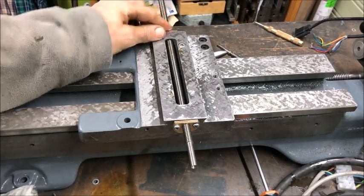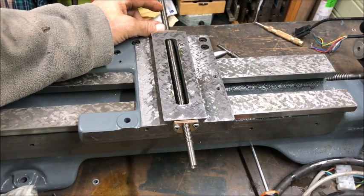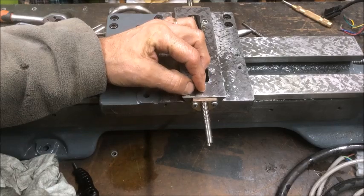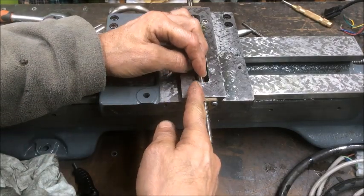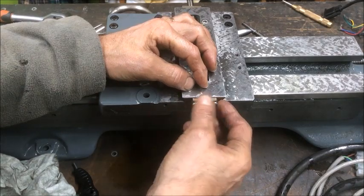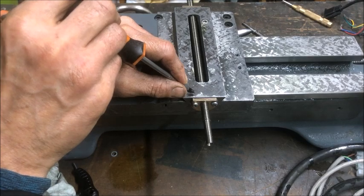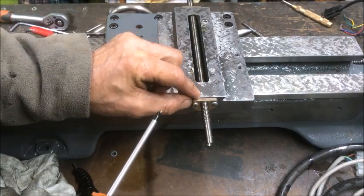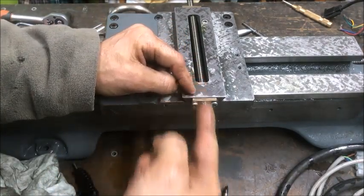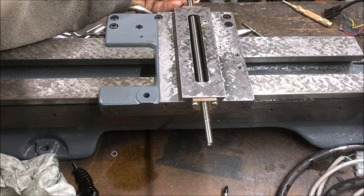This is fairly straightforward, and at the front I'll just adapt it to the normal handwheel. I could have turned it down to cut a shallow thread and used a set screw, or kept it smooth and turned down a collar stopped with a set screw for axial alignment. But with the washers as I have it here, I find that axial alignment is already taken care of.